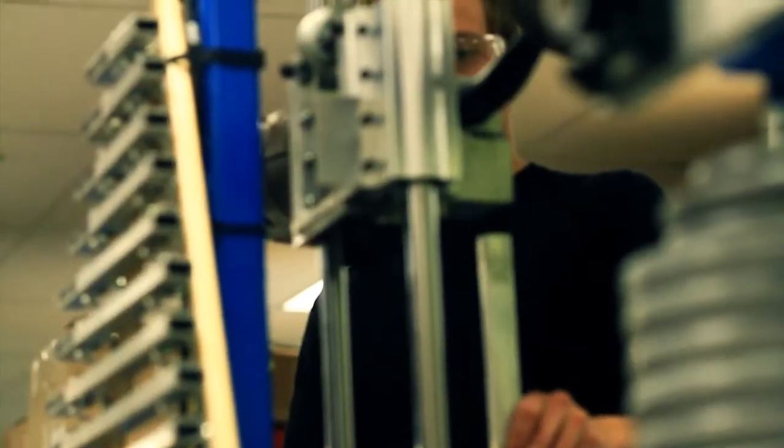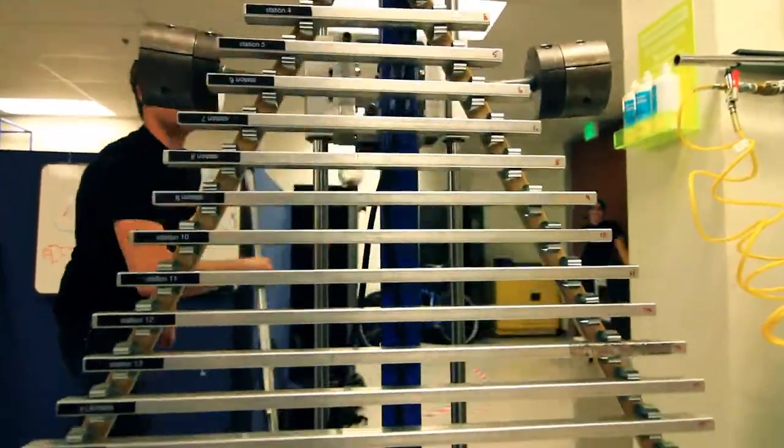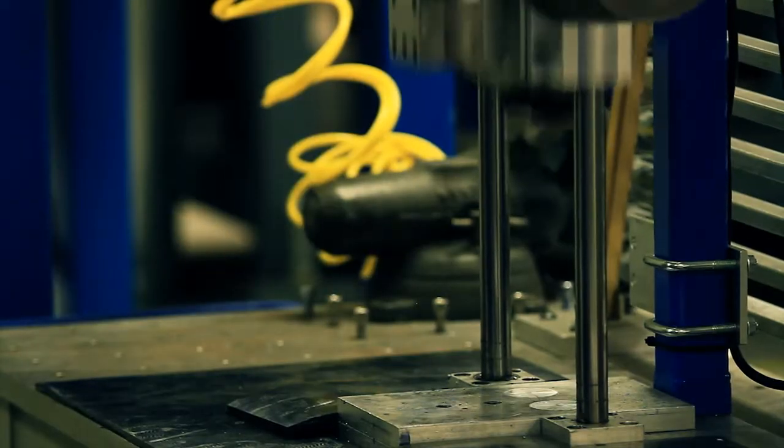The bars drop from a successively higher and higher series of stations. This fixture actually used to be much lower and we used to use a lighter weight, but through time handlebars have advanced and we've been able to make a better handlebar, so we've had to add more weight and actually extend the fixture so that we can put enough force into it that we're actually forcing a failure — because if you don't force a failure, you don't learn anything.